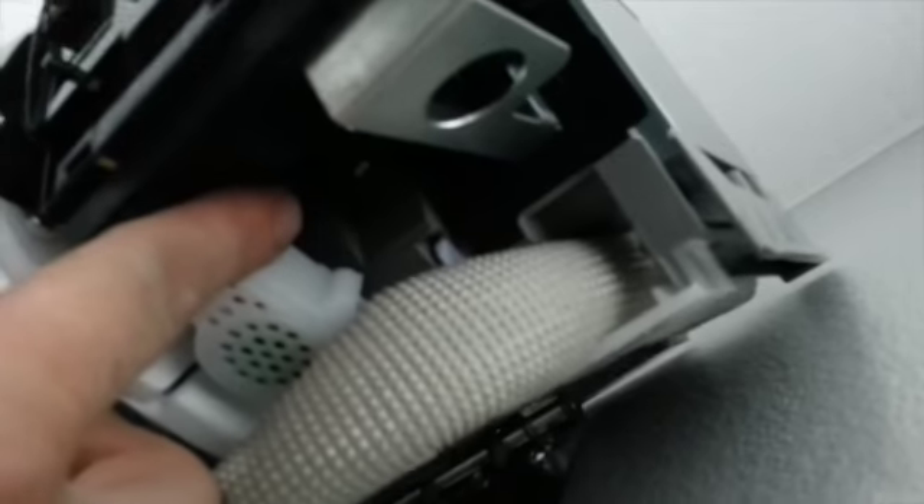I've got my connections done under the unit. It's kind of dark, but that's the port where the drain line was. I was actually able to, on these units, flip it around to the other side. So now the drain line's coming out here, and I can just tuck it into my hole back there — it'll be a lot shorter run and get the connection actually out of the house.